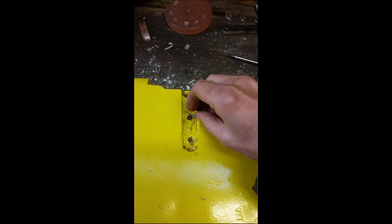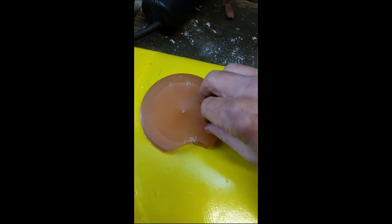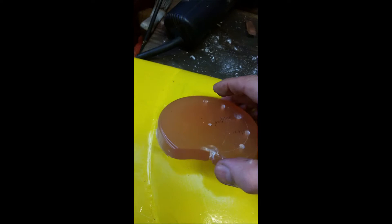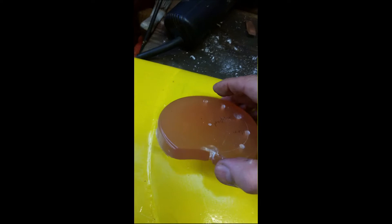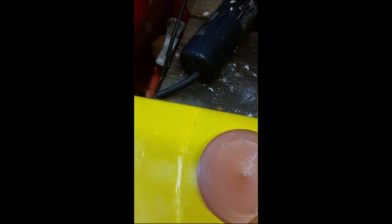I've been experimenting with a block of resin that I had, so I drilled the correct size hole for this screw. On the first attempt, forcing the screw into the hole basically just stripped the thread, probably because I wasn't applying enough pressure. On the second attempt, trying to apply a little bit more pressure, you can see that the epoxy being brittle meant quite a sizable piece broke away.